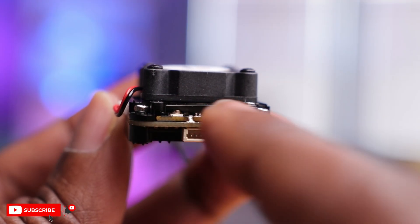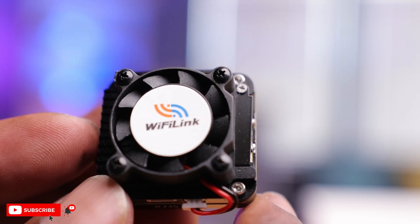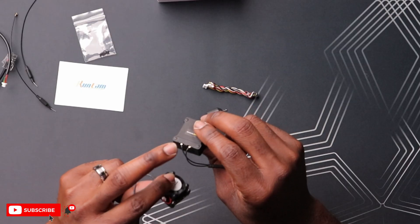The flight controller cable also provides power to the VTX, which is rated between 3S and 5S — a bit of a narrow range compared to the typical 2S to 6S. Most modern flight controllers have a 9-volt pad, which is what I'd use. Above that port are two UFL antenna connections, and there's a plate to secure the antennas to the VTX so they don't get unplugged in a crash — the same design seen on the DJI O4 and O3 air units.